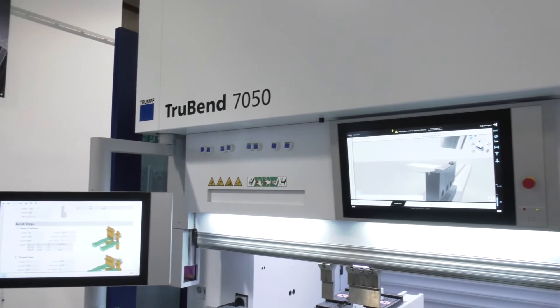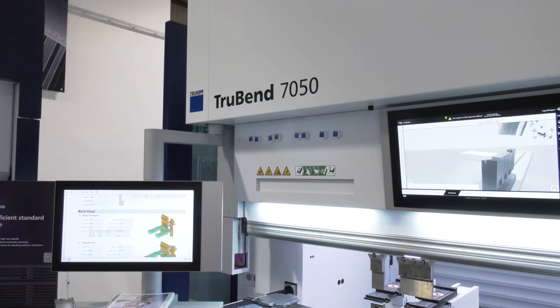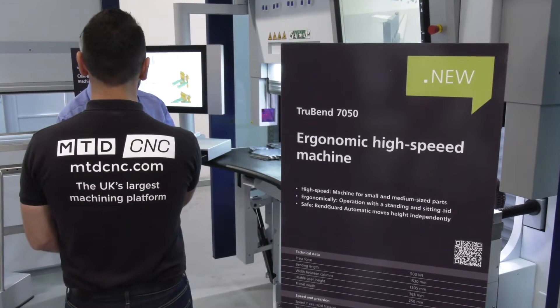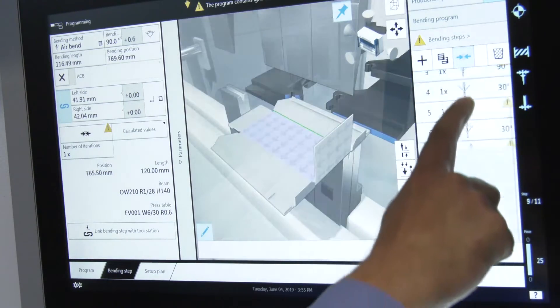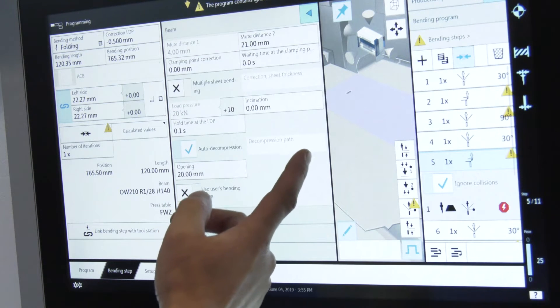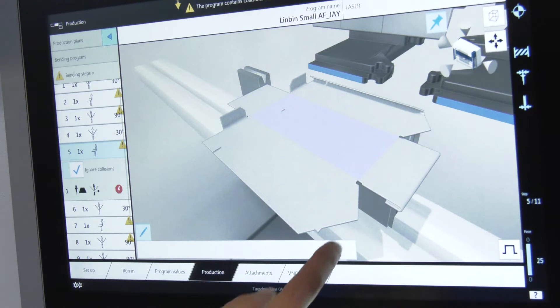With all these advancements, let's look at how easy it is to program. It's extremely easy. With the purchase of the machine, we offer three days of very comprehensive training. We start with the manual side — one bend only — then teach people how to put more than one bend together, and then more than one station across the machine. The touchscreen programming is very simple: you just draw a shape, designate a tool, and watch the program being generated by the machine. It puts all of your retractions in, your X dimensions, your Z dimensions, and it lights up to show you where to put the tools.